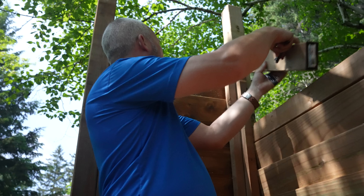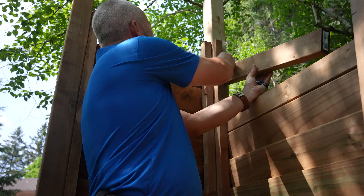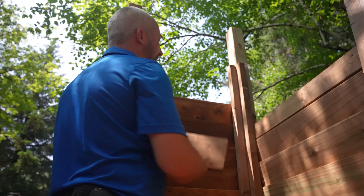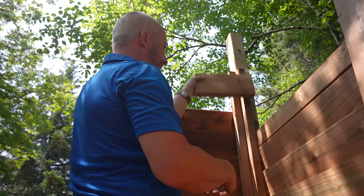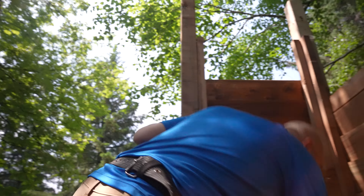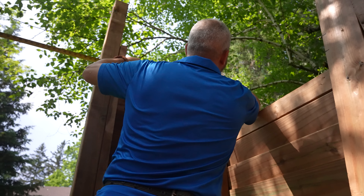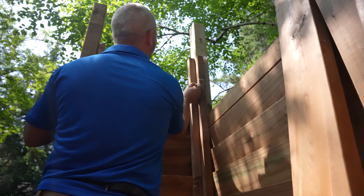I need to figure out exactly where I'm finishing off. This mark to the same location on the other side — that becomes the width of the new header. If I cut this off with my oscillating tool, I can put this right where I want it to the four by four at this point. First thing is to measure from the outside of that two by two — 103 and three-quarters. I'll write that down: 103 and three-quarters.